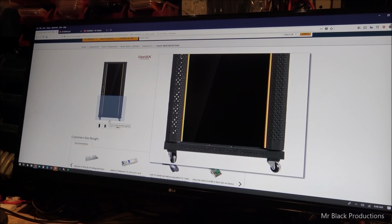So first I built a 3, then I built a 6, then I built a 10, then I went on and built a 15, and when I built the 15, that was Vader, and Vader has now morphed itself, because I originally spec'd the transformer on a pair of 20s, full out, full chooch, under load. Well, that's when I realized I don't need to do a pair of 20s. I can do a single tube, zero support, less air I've got to move, less current that the box is going to draw, because we're going to have a single filament.